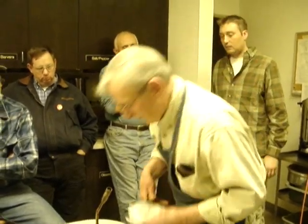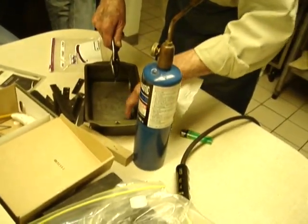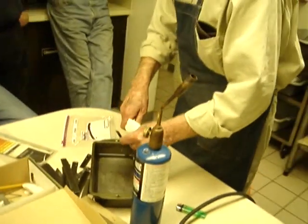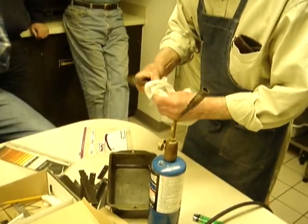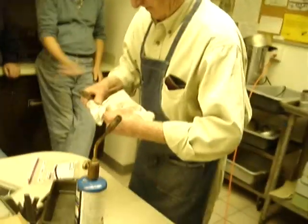I know in my business, I make horseshoes. Oh, that's right. You're a farrier. You have to quench them. Do that there. And you don't just stick them in the water, because they'll be rock hard. You can't move them. It's mild steel, but like you say, I can take them and hit them, and I'll break them, and it'll be that crystalline. If you come in and move the shoe, keep the shoe moving.